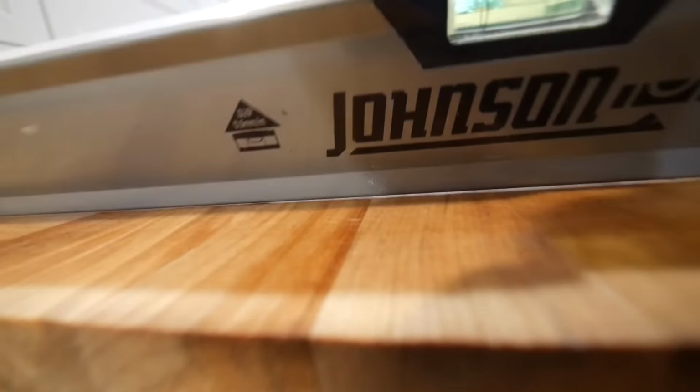You guys can see my brackets, and this one we also flipped over, and I'm starting to pocket hole it. I'm going to use pocket hole screws to join them together when they're in place. We're kind of making this up as we go, so we're hoping for the best, but I'm going to go ahead and drill my pocket holes. I tried putting them on the individual chunks of wood, that way I wouldn't be screwing in between boards on the other side. I want to do whatever I can to avoid any splitting anywhere.